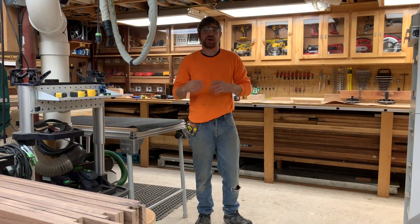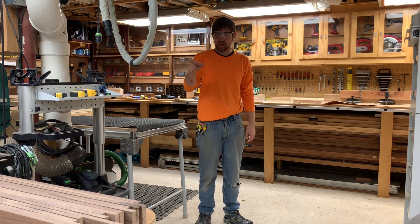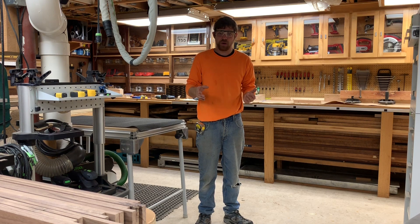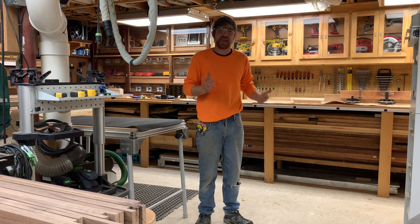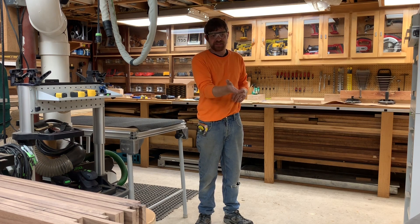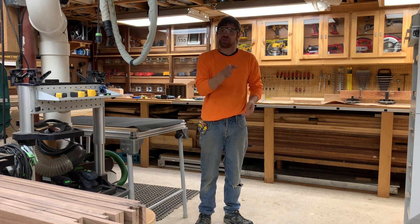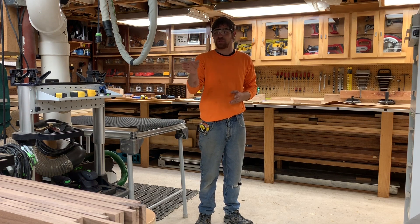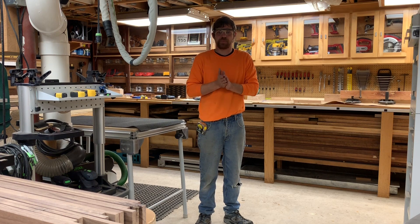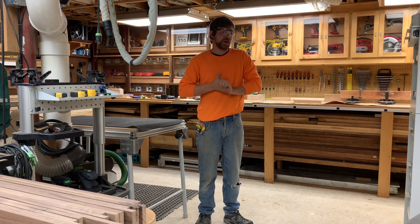I just wanted to share how I use the planer to rip boards to final width. I get away with this on multiple parts like these boxes or if I was doing face frames on a cabinet where I have multiple parts that need to be to width. You're obviously limited with the planer — I can go up to 8 inches. I'm using multiple boards and they're helping each other keep everything nice and square and standing up through the planer parallel.